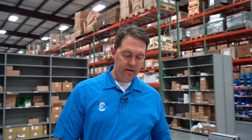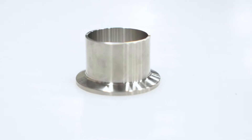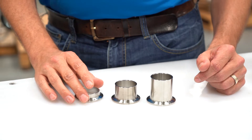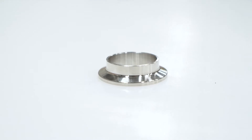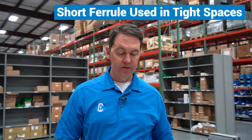The differences in these lengths are often referred to as tangent. Originally, when the tri-clamp ferrule really became prominent, the standard length was the most common size. The shorter ones were really only used by fittings manufacturers, but later as welding technology became more available to people in the field and in shops around the world, the short ferrules became a very common item to allow you to meet specific dimensional needs.